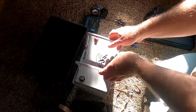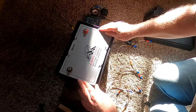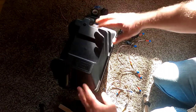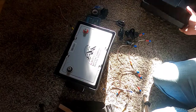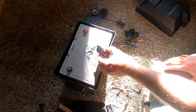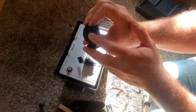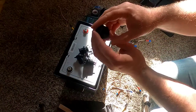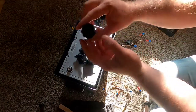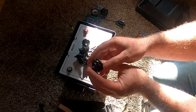I plan on simply dropping this battery right into the box. These battery boxes are designed for 12 volt 100 amp-hour sealed lead acid, but the lithium iron phosphate fits in without issue. I've got a 12 volt socket, USB with two outputs at 2.1 amps each, a little voltmeter to show battery voltage, and a rocker toggle switch to turn all components on and off.